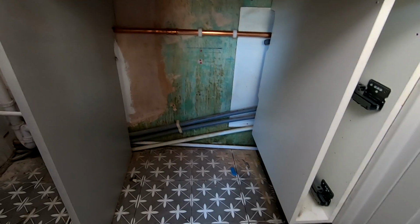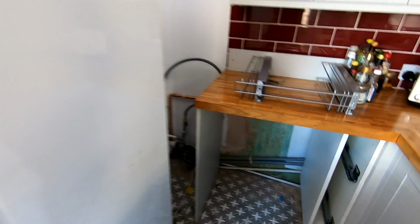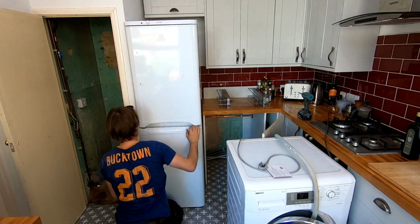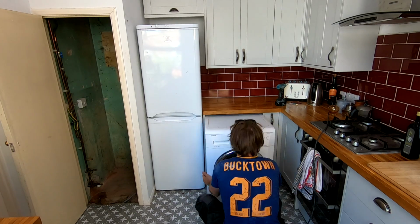So I've managed to push the pipe through inside the sleeve. Excellent. I've got gas run to the boiler cupboard, to the old airing cupboard, and condense as well behind the fridge. So now I can put the kitchen back together, hang the boiler on the wall, pipe it up, and then another difficult part. So gas was quite tricky, and another part is going to be doing this flue here in this box, and there is a big chance I'll have to take partially the box away, or maybe even the whole box away.